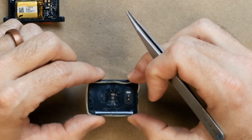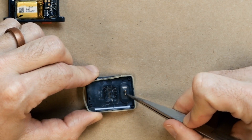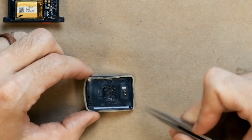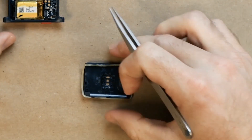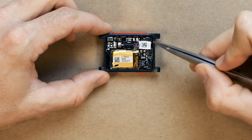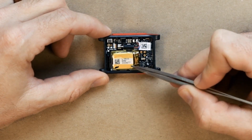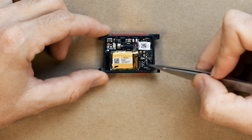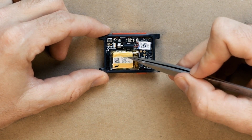So this piece is one piece of plastic, injection molded. Looks like they have some kind of epoxy in here to hold these pogo pins in. I'm actually not sure what these bosses are for here, because the screws are on the main board. The main board is held in with three super tiny screws. Here's the battery. You can see the battery is almost the same size as the entire PCB, so it's a real fine balance between battery size and battery life.